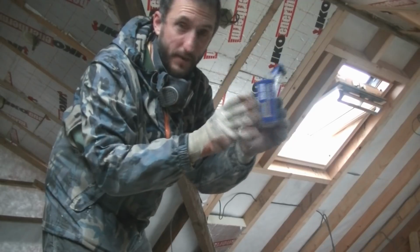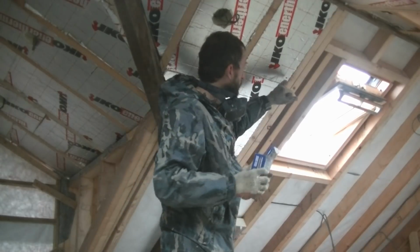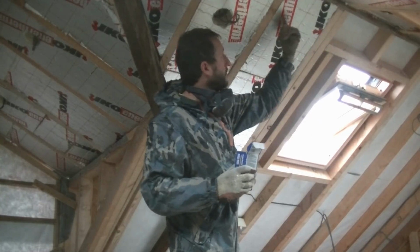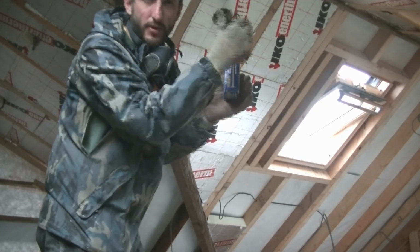I found this the best thing for me. And if you get a piece of insulation board which is slightly loose, then all I've been doing, just so it doesn't fall back out, is putting some screws, one there, one there, one there and one there. Now that's not on every board, I've just been doing it on those ones that are, like I say, ever so slightly loose, and if you gave them a knock they would come out.